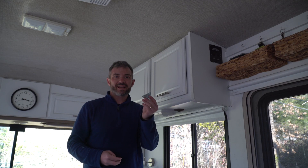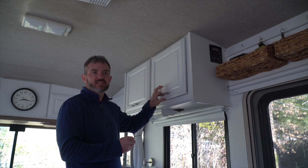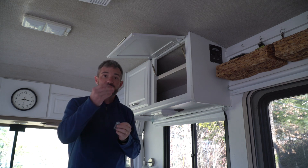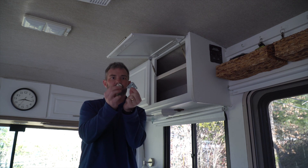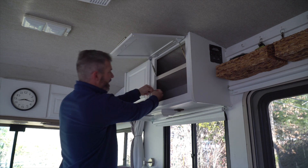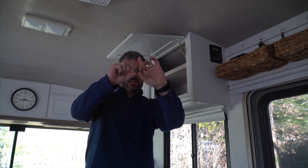Our clips — the brackets that hold the struts to the actual cabinet itself — this is what comes with the struts, and this is what I'm going to be using instead. You can see the difference in surface contact. With the smaller ones you can normally only get about two of the screw holes engaged, whereas with the bigger one you can use all three because it's more in a straight line. And the difference between the screws — the width, the length, and the meatiness of the screws — this bigger bracket is going to have much more contact and give us a lot more strength for the struts and these doors moving up and down, because we open these doors many times every day.